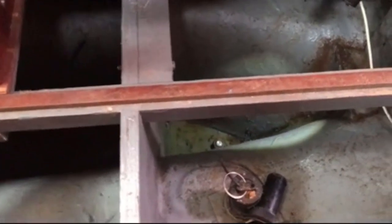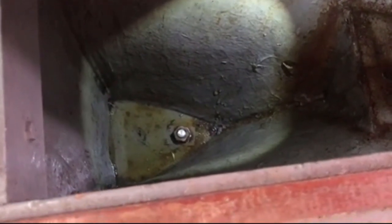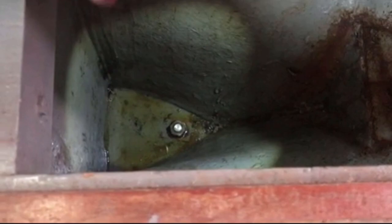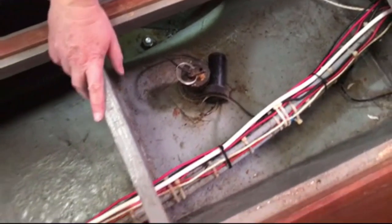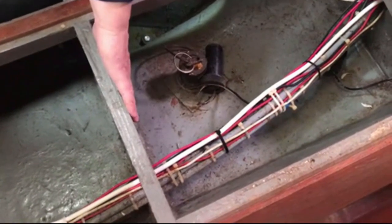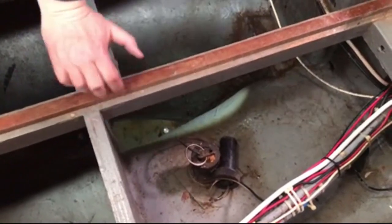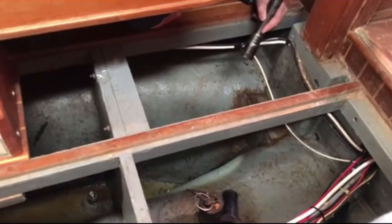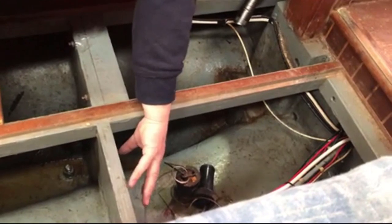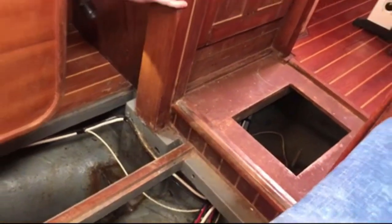The keel bolts on a Westerly are made out of stainless steel — good quality and quite thick — so they don't usually cause a problem. You can get movement between the hull and the keel but this one seems to be okay. With these bigger Westerlies, the transverse beams and stiffeners are actually very strong. These are called the floors, and this is called the sole — not the floor of a house; the sole board is what you stand on. This is very strong and well made. On the smaller Westerlies like the GK29 these floors are much smaller and they break, but this one is massive and strong. The mast compression post looks okay but it's quite wet and needs to be kept dry.